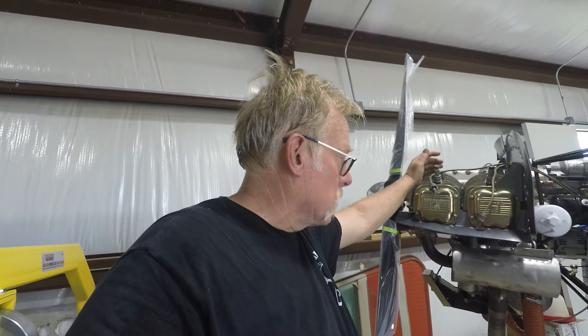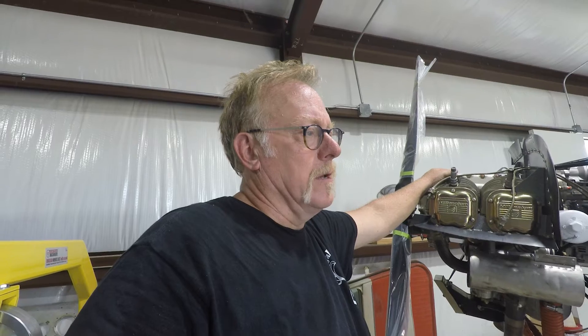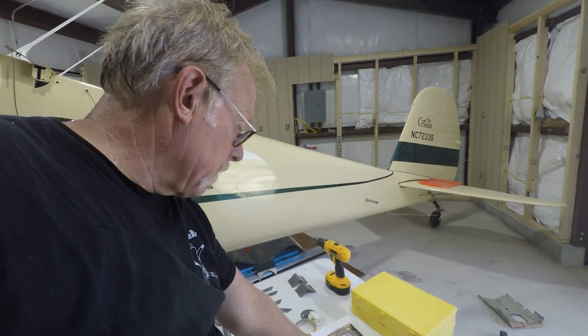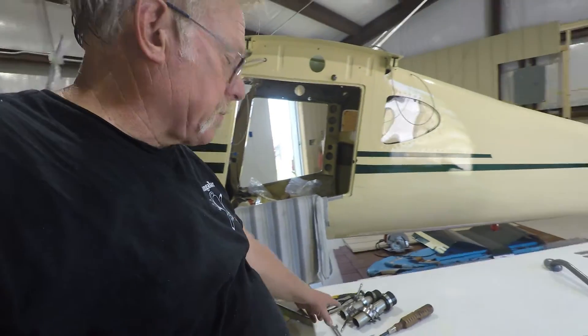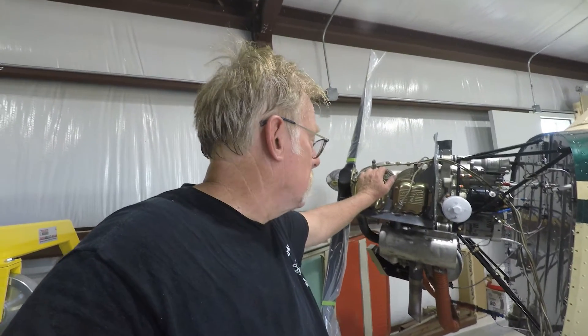Side fittings and everything was great. The draft tube — this joins the two lower pieces, got to make sure that gets on. We've got special instructions on putting that on. The inter-cylinder baffles should be pretty easy. I've got to put the intake pipes back on — call that ten minutes of futzing around. Biggest thing I want to do is make sure all the torques are set and get everything back to spec — anything that we've touched is back to spec.